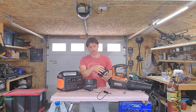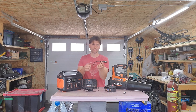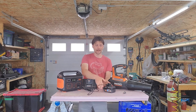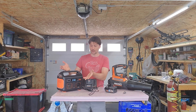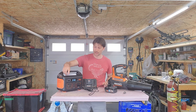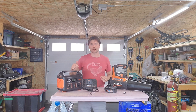What I did is take the wires — they come off the battery at 18 volts — and put them into this female cigarette socket. This normally plugs into your car at 12 or 14.4 volts when running. Simply plug it in and now I'm actually charging the power bank off of my 18 volt tool battery. It works great — it charges at about the same rate as plugging into the wall, a car, or a solar panel. It's currently charging at about 67 to 68 watts, though it's at 98% capacity right now.